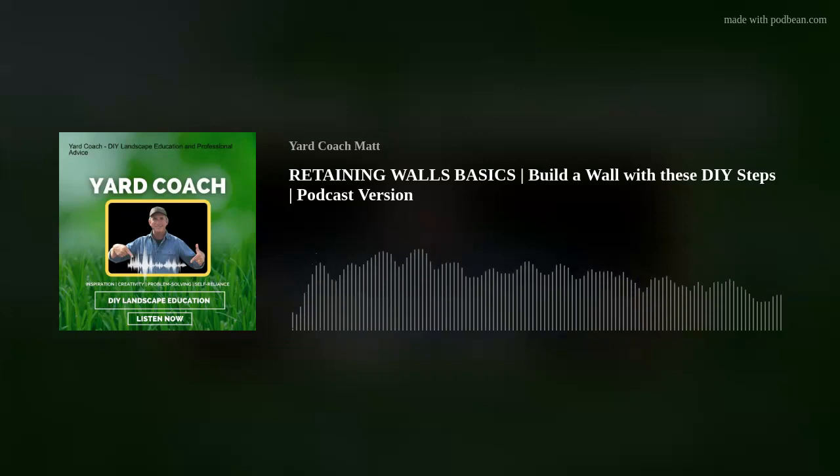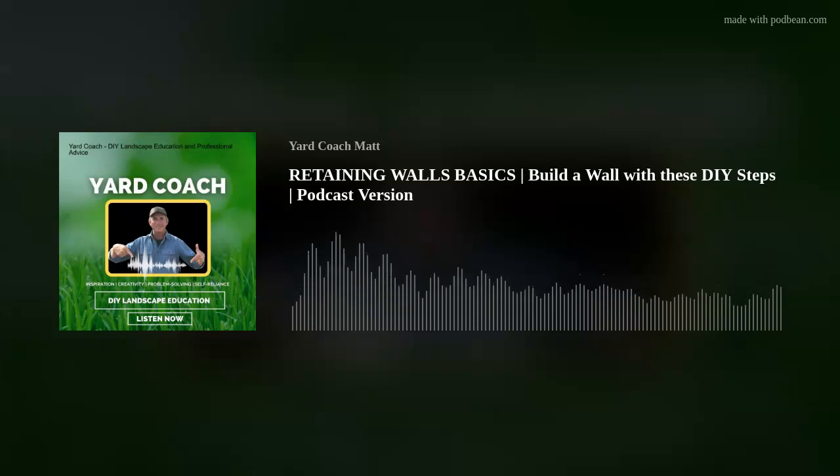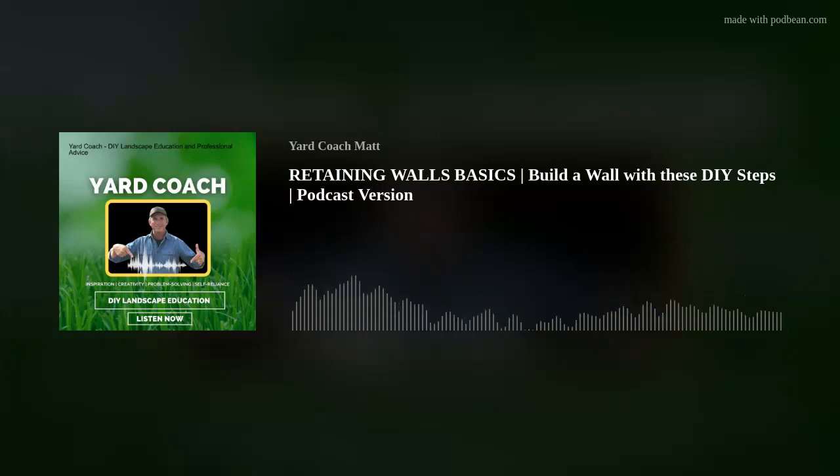Take the layers to the desired height, usually about 3 to 4 feet. But since that first base course was done, it's automatic that the stackable blocks that are going in there will sit level, unless there's a little piece of block material that adhered during the building of that block. Make sure that you don't have little tags or something, that it sits on itself nice and level. You'll put up the next 2 or 3 courses most of the time in a day, and it goes along very, very fast. You just have to get the material to the wall.